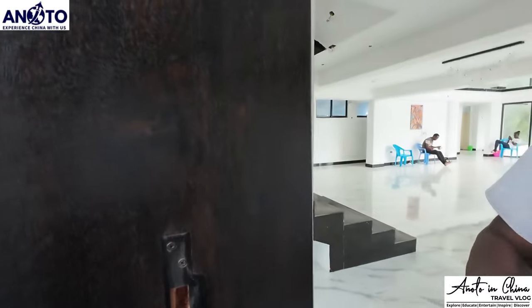It's dark. Black. So the stain is something that you apply on a piece of wood to change the original shade, to give it the shade that you want. So in this case, we wanted a walnut shade, which is darker, that will match with our color scheme. There's also a mahogany stain that you can put on that will enhance the mahogany color in it. We also have some stain like pine that will lighten the wood. So we have different stains. So stain is just changing it from its natural color to the shade that you want. So that's what we call staining.